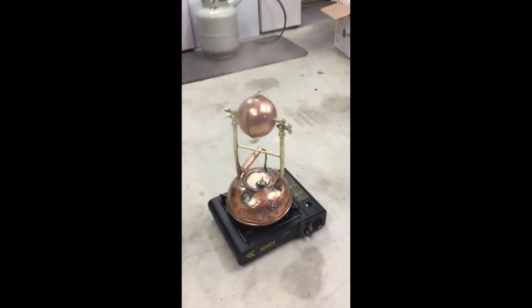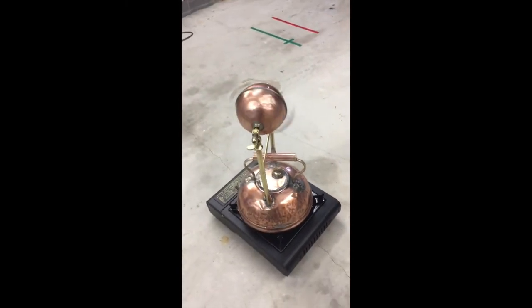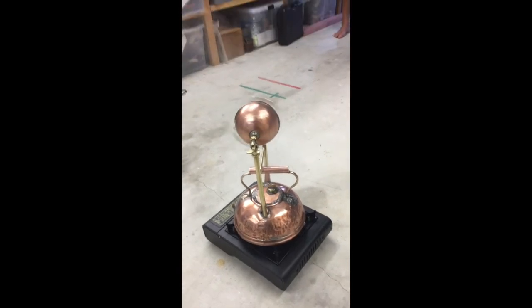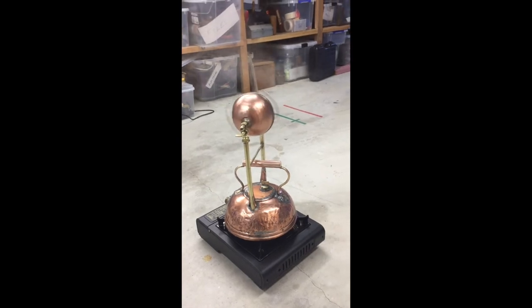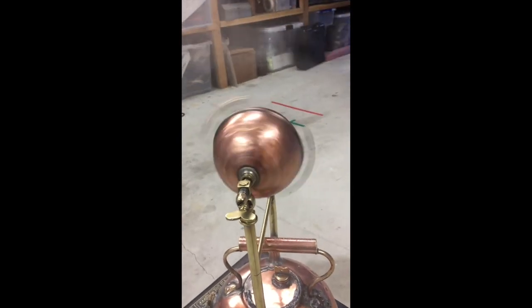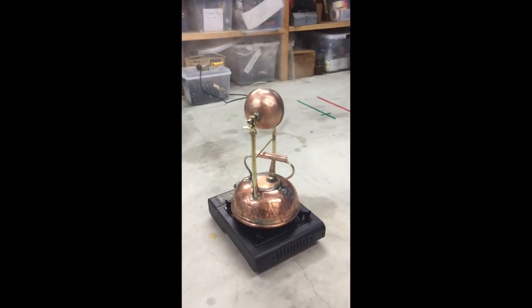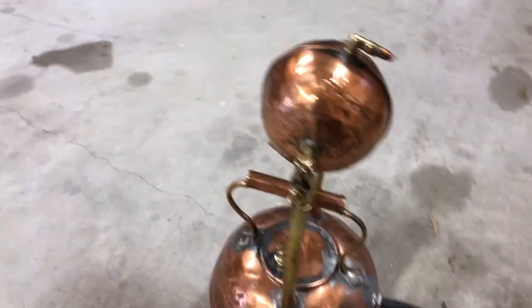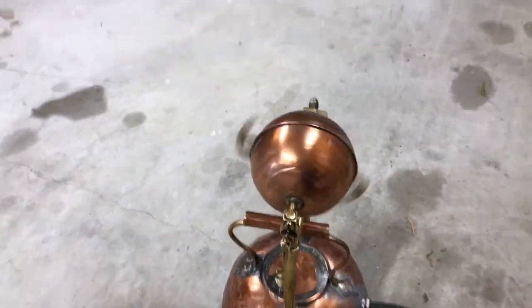Eventually I put it on top of a little camping gas cooker and demonstrated it would work on steam, and then decided it might be a little safer for testing to run it on compressed air. So I got an LPG cylinder, filled it up with compressed air, and hooked that up to it. It actually went quite a lot faster because it was getting more air through it than with the steam, and it would go faster and faster until it got out of balance and then the ball would come flying out with vibration.